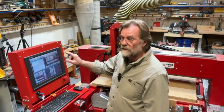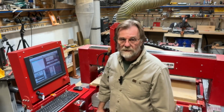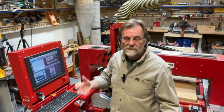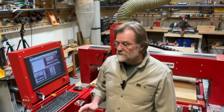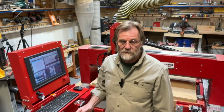Because I told it I was going to pick up number 12, when you look at the tool and spindle, it says 12. So if I wanted to put this tool away, it wouldn't go to the rack. It would come back up here to me because it's in manual tool change mode. Now the next thing I'm going to do to make this easy for me is I'm going to hit the control, go to the control page.